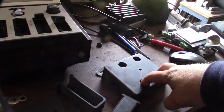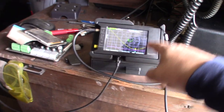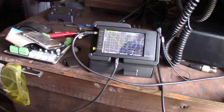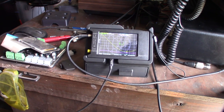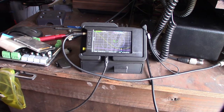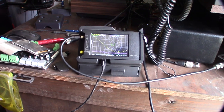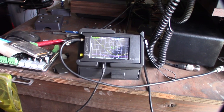All right, so I'm gonna go back on the roof and flip it to the horizontal. Right now it's in vertical, and in vertical I'm getting the resonant frequency, it's a really weird drop. It's not a flat drop at all. Originally I tuned it horizontally, because I have a Starduster M400 that I want to use as a vertical. Or actually, I was thinking about using this as a vertical and make another horizontal dipole.